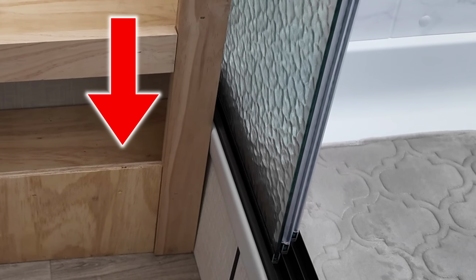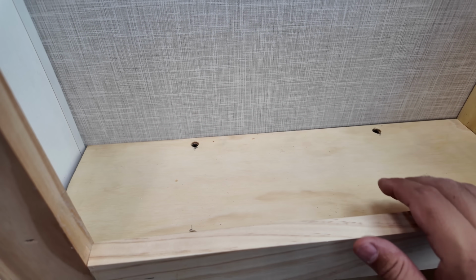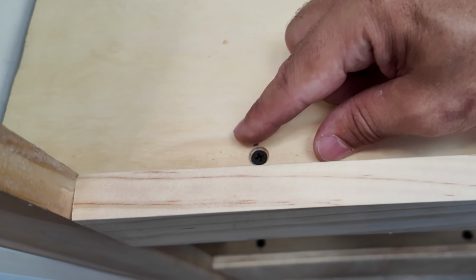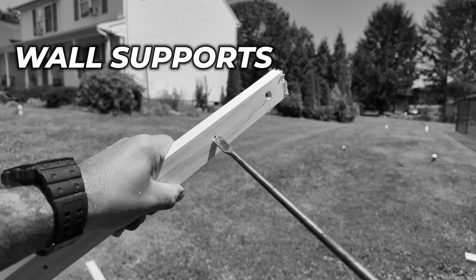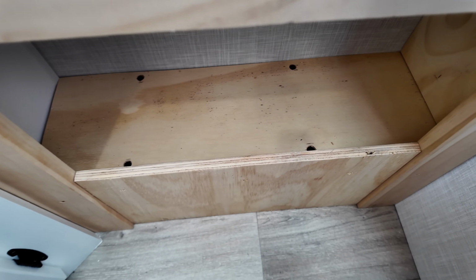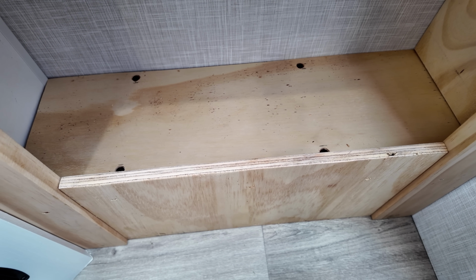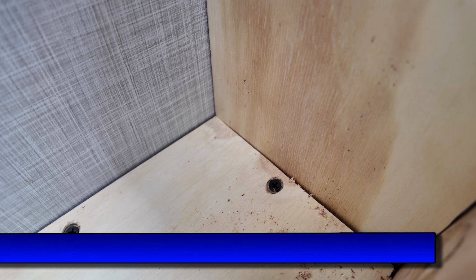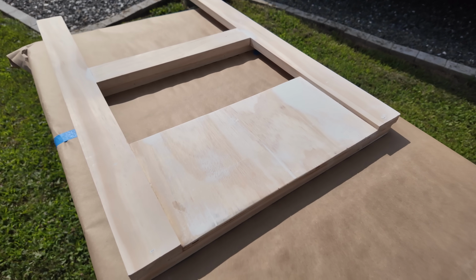Once your 2 shelves and side piece are dropped in, square everything up and drop some screws through the shelves into the supports underneath. I chose 2 screws in the back and 2 in the front. As I mentioned earlier, you don't have to countersink the screws for the supports on the wall, but you probably should countersink these shelf screws so whatever you put on these shelves doesn't get caught on the screws. I also angled a screw through the shelves into the side piece so that it is held in place. Full disclaimer, I did apply and wet sand some filler to this bottom piece.